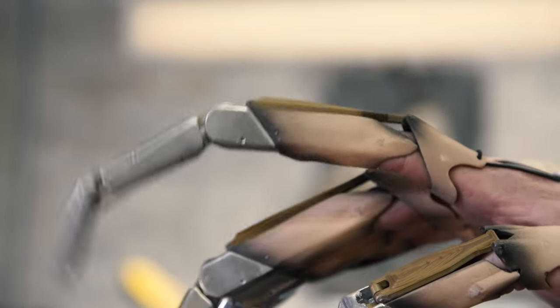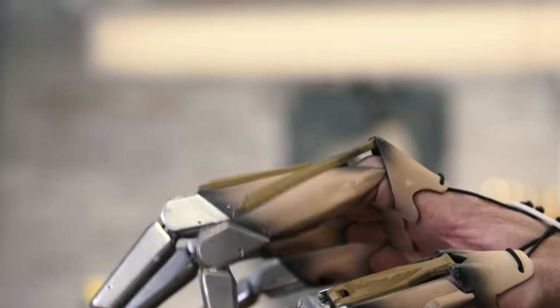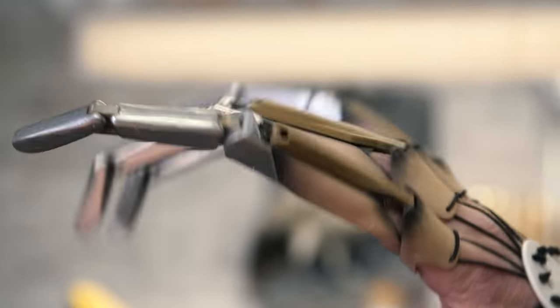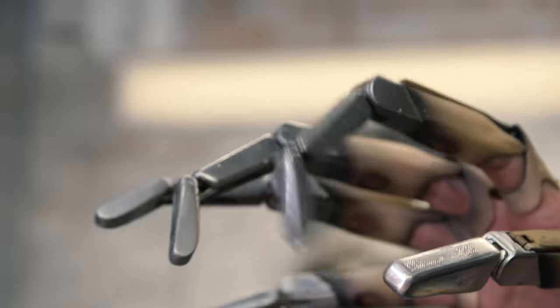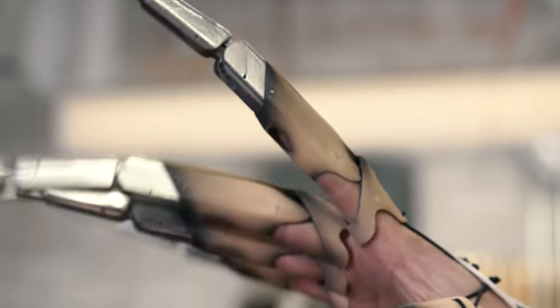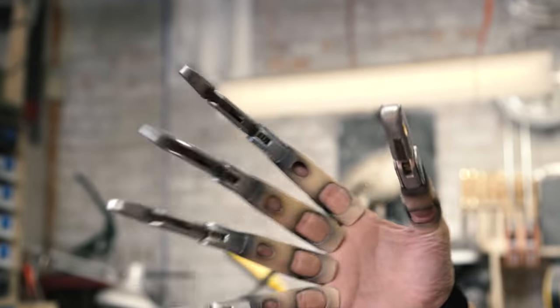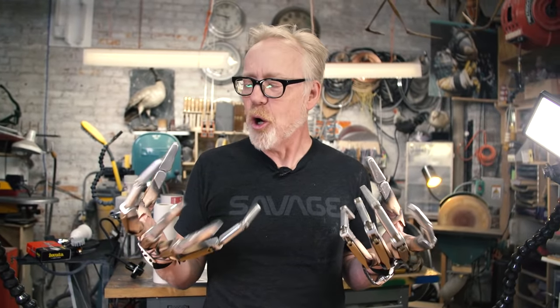So the way it works: there's a collar that goes around the base of my finger — that's the stationary part. Then the part that I'm actually moving with my finger, which is that fleshy bit at the end of my index finger, activates a lever off the base. That's connected to a gear at the first knuckle, and then there's a parallelogram between the first and second knuckle that adds secondary bending. It's really lovely.